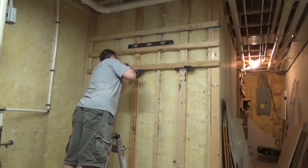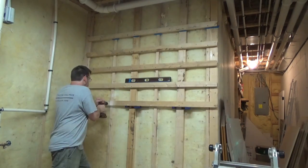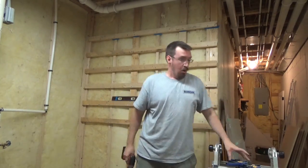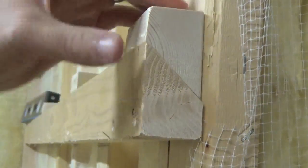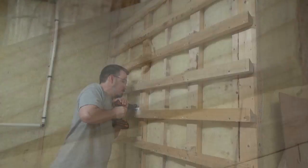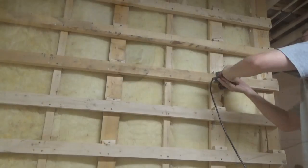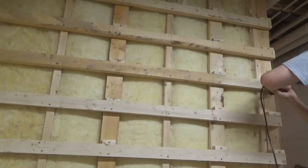I made sure each cleat was level and that each one was spaced exactly nine inches from the next. To keep the cleats from twisting on the wall, I glued in some torsion blocks that I made from another 45 degree cutoff. I put in four per cleat, and once they were dry I screwed them to the studs as well — this really firmed things up. After sanding the faces, the wall cleats are done.